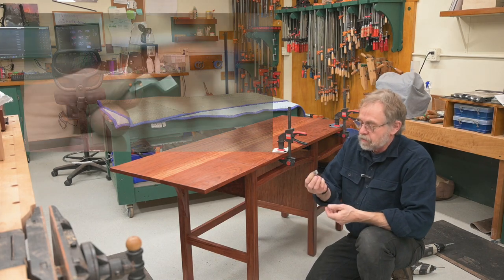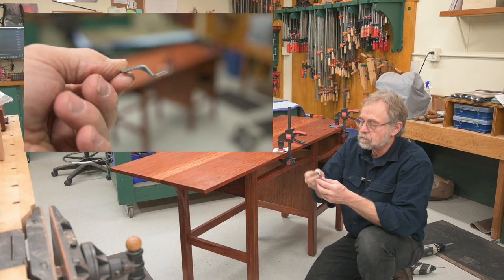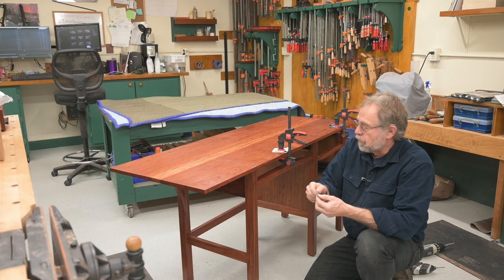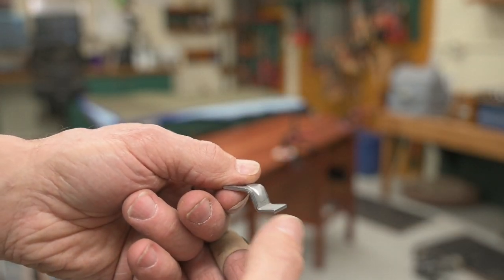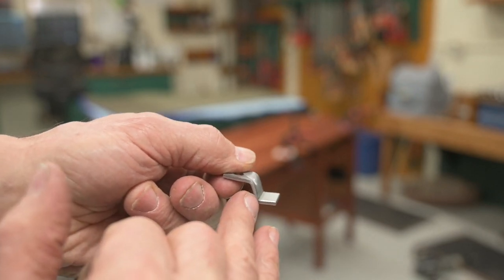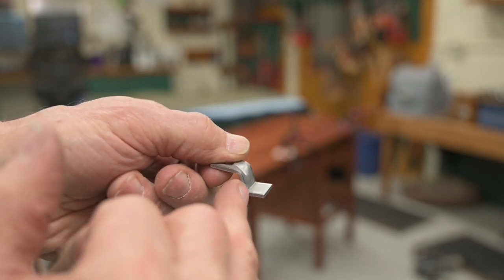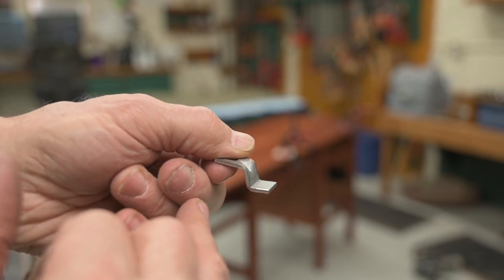Now, these are the tabletop fasteners we're using. Keep in mind how they work. When they attach in here, this little ledge here is what's catching. It's supposed to move back and forth on here. You want to catch somewhere in the center there. You don't want it to be up against that edge and have it contract, and then you're in trouble. It has no room to move.